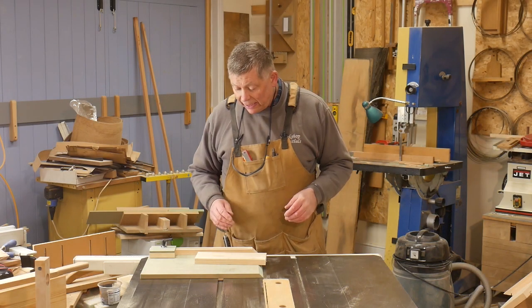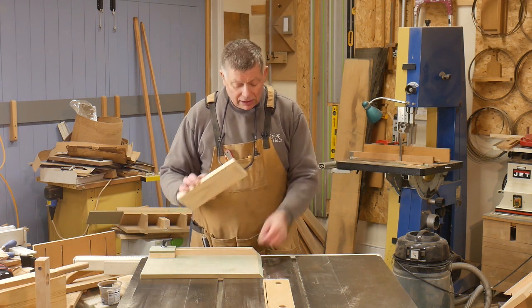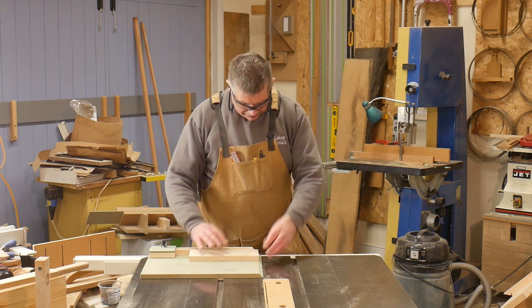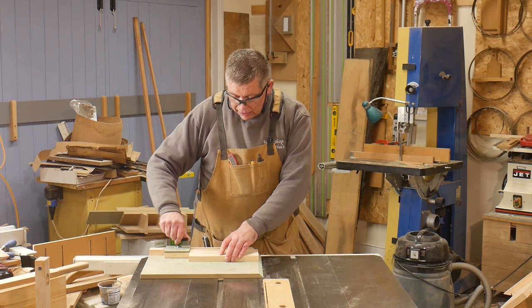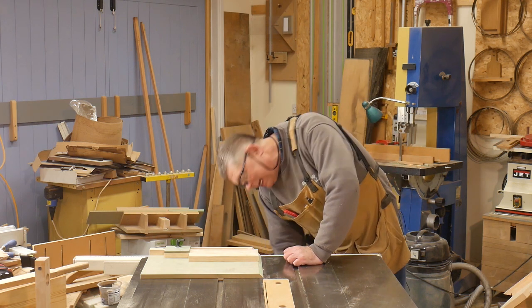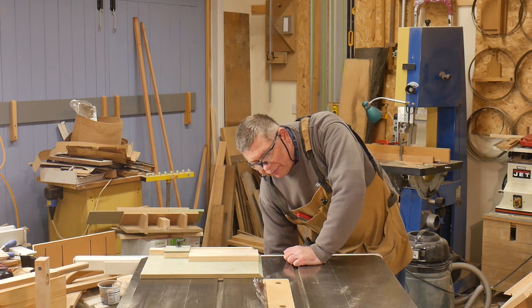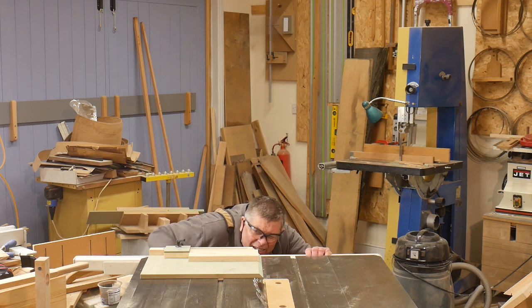Right, I've got myself set up with my jig and work piece. The bottom edge of this goes very slightly over the top edge of the jig — about like that. The stop goes up to it like so. I've put in a zero-clearance throat plate that's been cut at 45 degrees, and I need to raise the blade so it just clears the top surface like that.